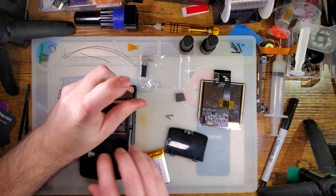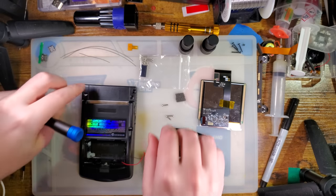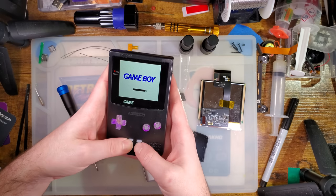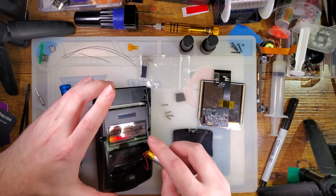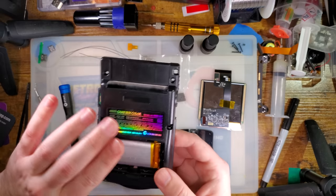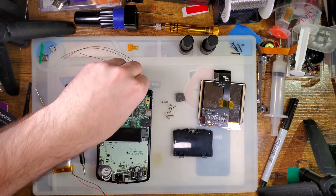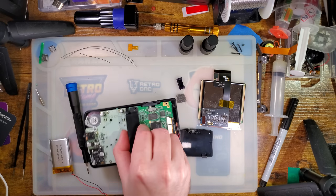There are some functionality differences. On the kit installed in this Game Boy, there's no alternate logo position — if you hold start and select it doesn't matter how long you hold, it's never going to change the logo position, because this kit predates that feature. Very careful with these battery connectors — they're extremely easy to damage. I'll use the same IR cover and screws, and let's go ahead and get this desoldered.